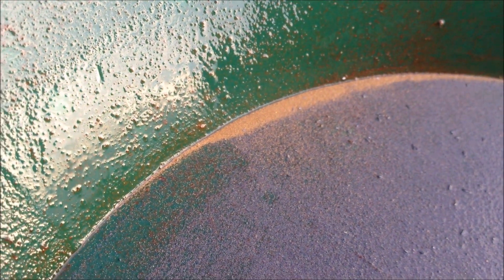This is the pan of the number one high-grade concentrates off the table from the first run of printed circuit boards. This is the nice gold line — this is really quite rich material compared to most ore that we run. We're looking at gold that is very very fine, probably 200-minus mesh, and there's quite a lot of it. The gray material in the pan — I suspect a good part of it is solder, lead-tin solder. We see a couple of straight particle pieces, but other than the gold and the gray there's nothing else really to differentiate at this point.